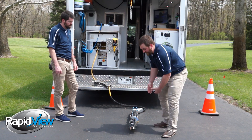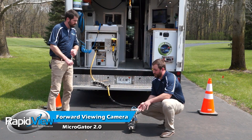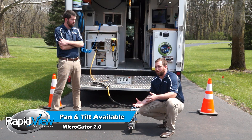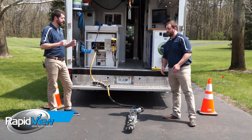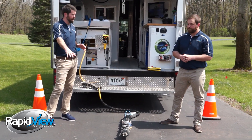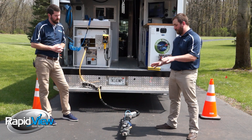That's the one camera view. The other camera view is a front camera on the Micro Gator, which allows the operator to see forwards in the pipe. You can remove this front camera and attach a pan and tilt camera — that way you can do your pre-inspection and post-inspection all with one unit. One controller is still able to work that front pan, tilt, and zoom camera head for pre and post inspections. No extra cable or extra controller required.